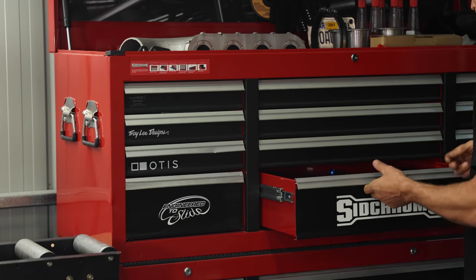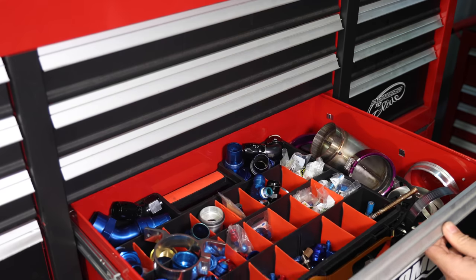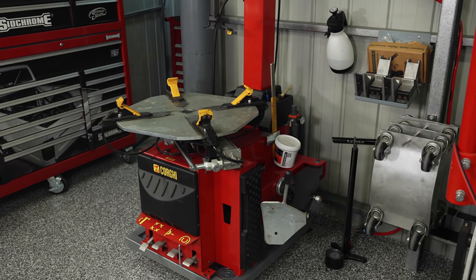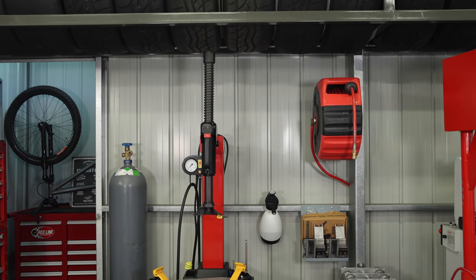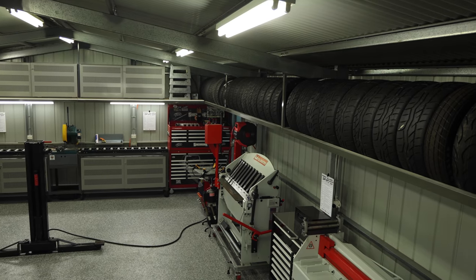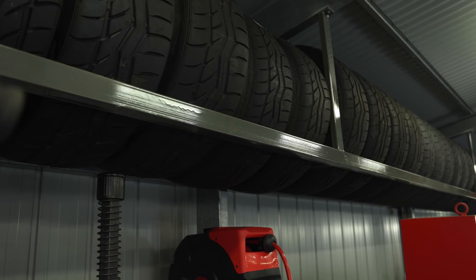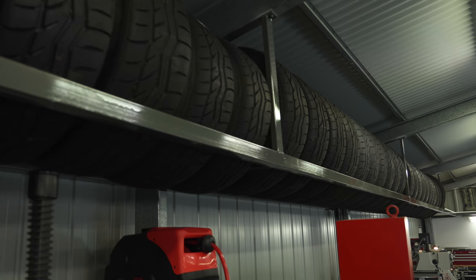Over in this corner of the workshop we've got a toolbox which obviously houses tools. This is really handy as I've got more tools over the other side of the garage, but this one is great for working on vehicles and is easily maneuverable being on wheels — I can take it out into the driveway. I have a tire changer as well, which is really handy as I regularly attend drift events. Up above me I have all the spare tires on wheels, and this is probably one of the biggest ways you can save floor space in a workshop — get these bulky things up out of the way. The tire rack stretches the entire 12-meter length of the roof and is constructed out of 50 by 50 by 1.6 millimeter thick square steel tubing, all braced back to the garage.